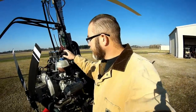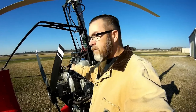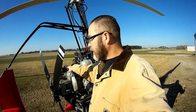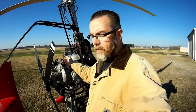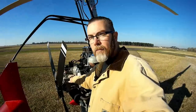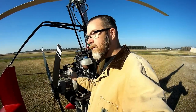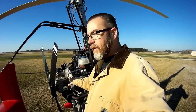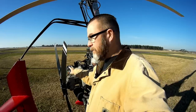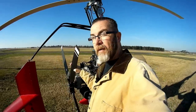I've added a couple of parts that came with the engine. Had a couple of carbs, Weber 3236, a Crane electronic ignition; the distributor I changed out from the points to the electronic ignition. Had to buy a new starter, had to buy this gearbox, and had to buy this prop. Now, 68 Ivo didn't work out very well with this gearing, as I explained last week. With this RPM and this gearbox, the prop that I had just wasn't turning fast enough to produce the thrust I needed to fly.